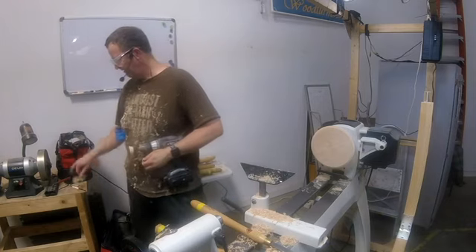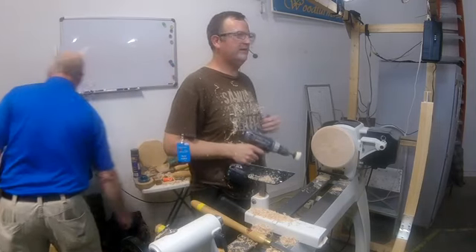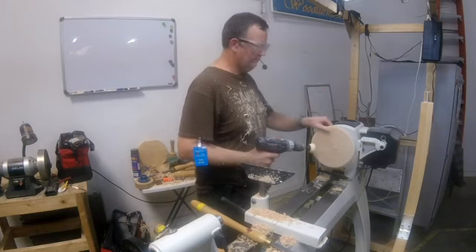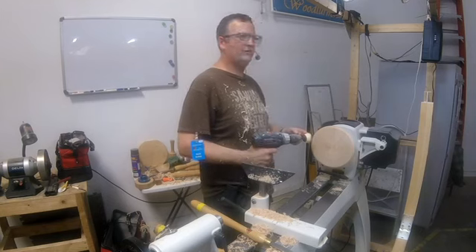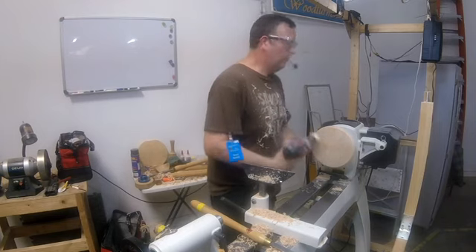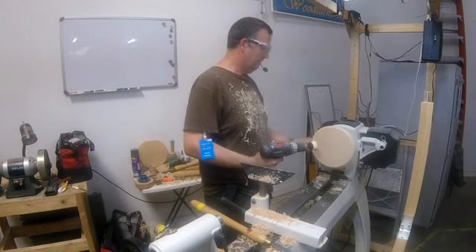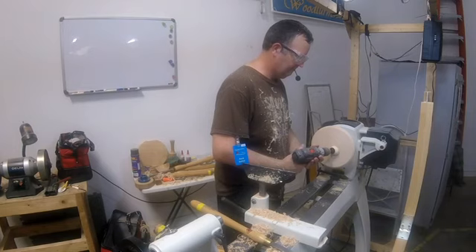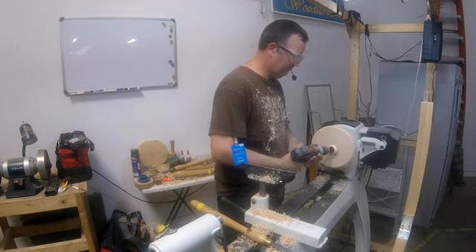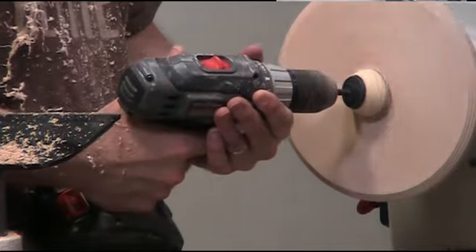To use a scraper: I'm going to be angled down, just about on the center line or slightly above. Always put that scraper up underneath your arm. You can see the kind of shavings I'm taking — I'm not taking much. I'm getting much closer to flat now — the same high spots are still the same, but I'm rotating where I use the sharp edge of the tool. This is the point where I get the sander out. I'm just going to show you one grit so you see how to do it. When the lathe is turning one direction, you want to have your drill going the opposite way — you're only going to sand with the side going the opposite direction.